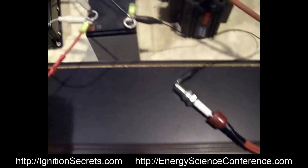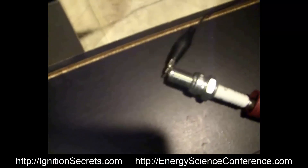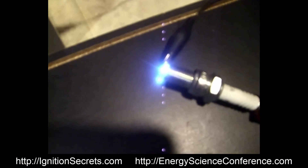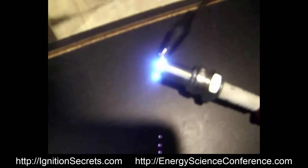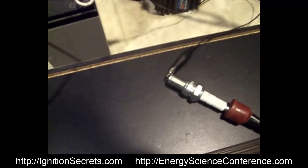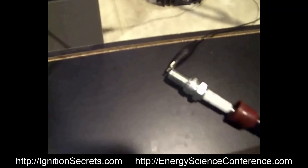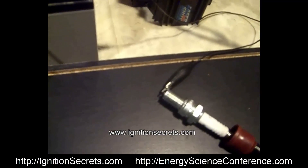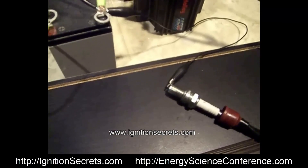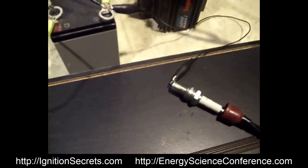I'll go ahead and turn on the timer right here — I've got it on slow. And that is the plasma. I'm going to turn it up full speed here. And that's an impressive blast. This video is not going to do it justice because you're not going to hear how loud it actually is and you're not going to see how bright it actually is, but it's actually very impressive. I have that gap closed up quite a bit, and I'm going to open it up just a little so you can see it. When you get the gap open a little bit more, you get a more time-compressed discharge because it has to build up a little more before it discharges across, and it's quite a bit more powerful.